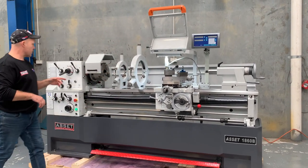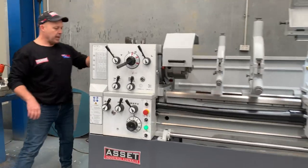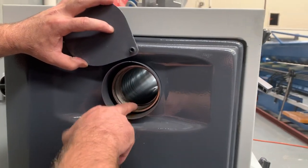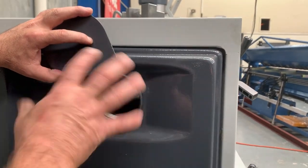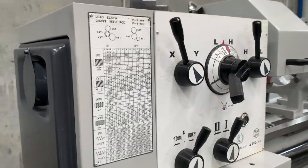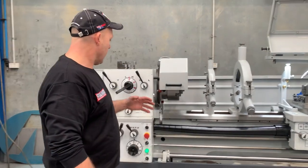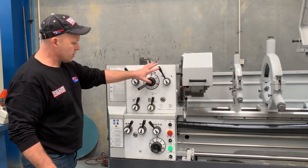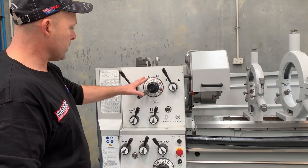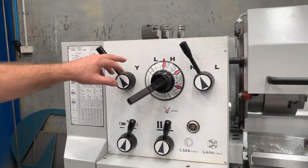It has metric calibrations. Coming around this side, we've got an 80mm spindle bore, and what we also do with our lathes is thread our spindle bore. So sometimes people want to put a spigot, a spider, or a rear support system there as well. We run precision headstock bearings, of course being an Asset Industrial precision lathe. All your headstock settings here are nice and easy to use. You've got basically high and low range — this is like a Colchester type speed system with high and low and X and Y.